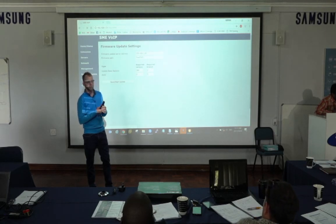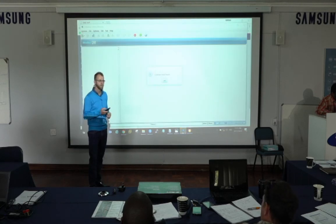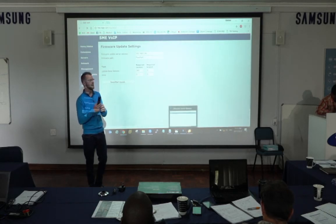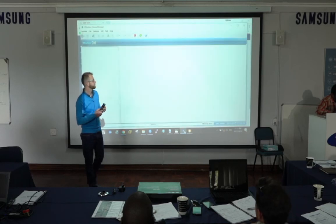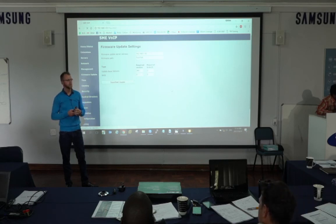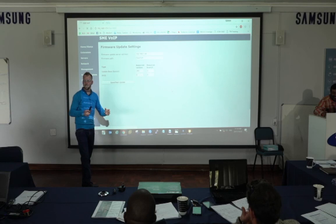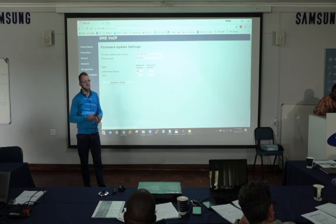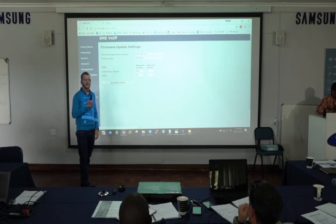Also, when you do menu *IP*, so *47*, it will give you the dB readings between the handset and the base. So if a client says that when they walk to this corner, speech quality starts deteriorating, then you know that's a dead spot. Tell the client, don't walk there. Move the base a bit closer. Put the base in the middle of the office. Don't put the base inside the server room in the basement when you're using the phones two floors up. It needs to be in the premises where the handsets are.